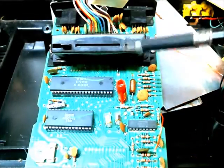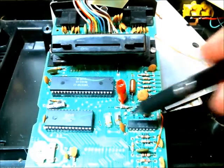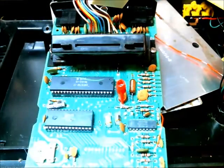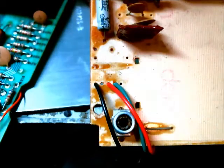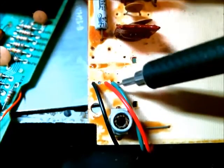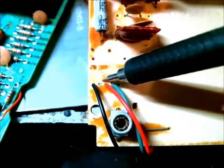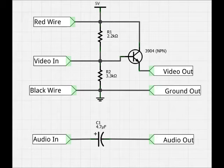Here's a more distant view — the cartridge goes in here, and this is where the transistor used to be. You can clip it out or solder it out. Once you've removed the RF modulator, you have five pins it was connected to. The three pins you want are: ground (first pin), VCC (third pin), and video in (fourth pin). The green wire connects to that schematic. The red wire connects to the five-volt potential, the black wire to ground below resistor R2, and the green wire is video in.